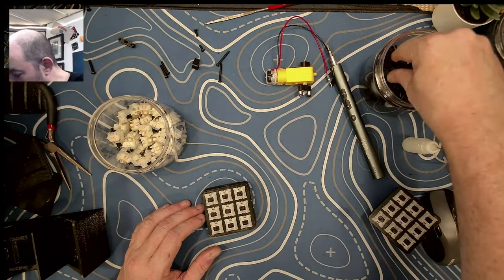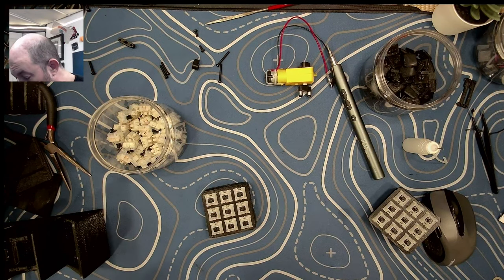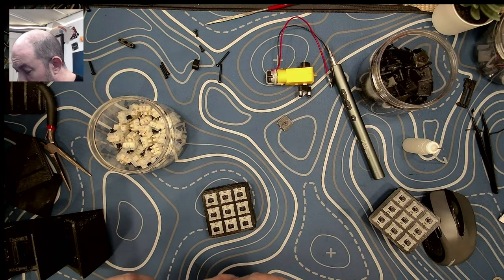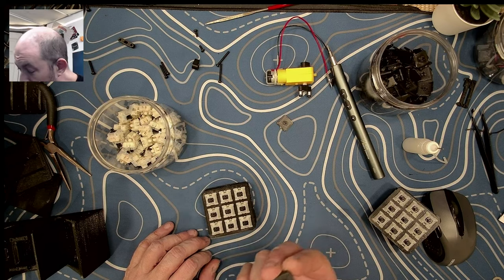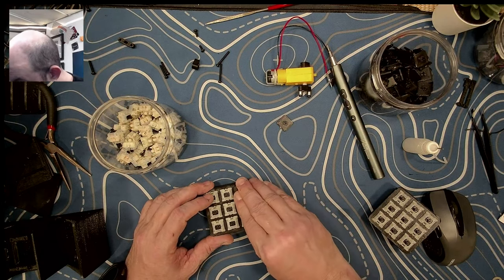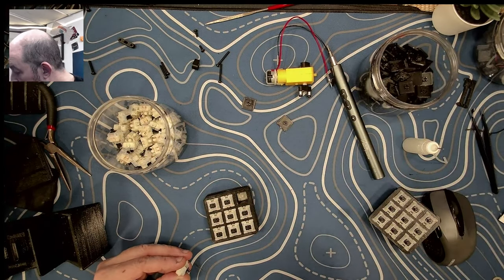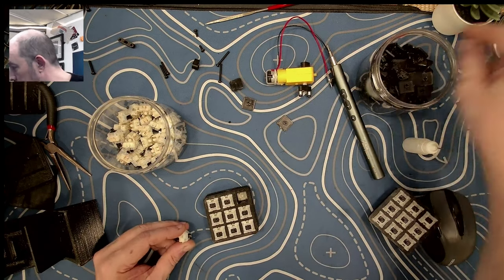All right, so here's one of the things that I made changes with. These are the caps the project comes with. They're these flat caps that come in a 10 strip. I mean, you can print them one by one. I'm printing on an Ender 3, and I really need to calibrate the E-steps. I just haven't had a chance. While they do work and they do go on, sometimes you get this where they'll just get stuck down inside of the switch. Let me see, I had to print so many of these because I've only been able to use them once and then it just breaks and it's done. So there.